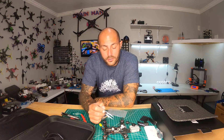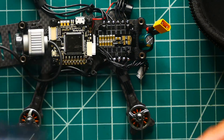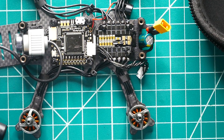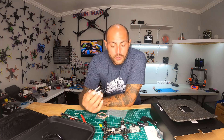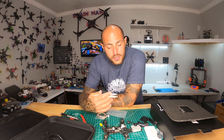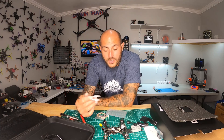If you have plans of pulling this DJI air unit out and putting a regular VTX in, you're going to need an OSD chip — something like a little OSD mini that you wire up to a UART, set up in Betaflight's ports tab and OSD tab, and you'll have full Betaflight OSD. Or you can put in a TBS Unified Evo and get basic stats like voltage, a timer, and VTX channel.